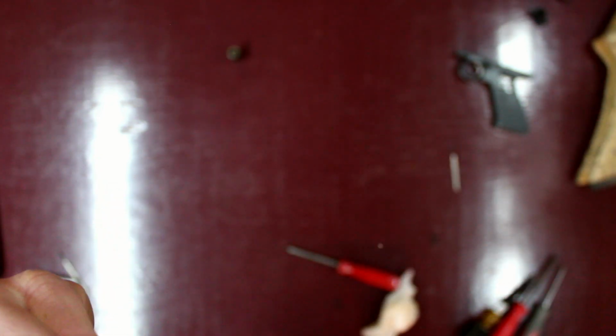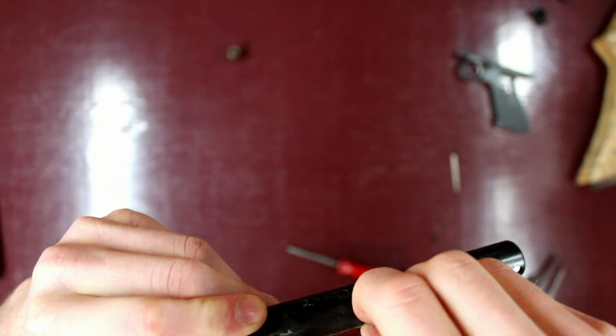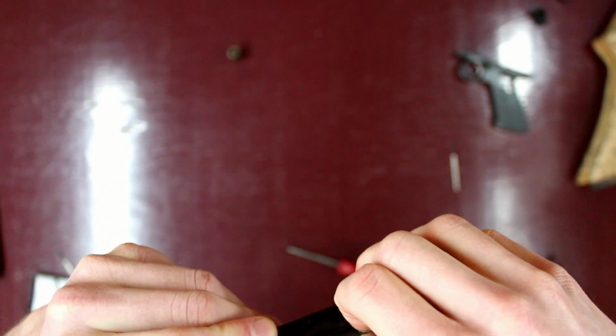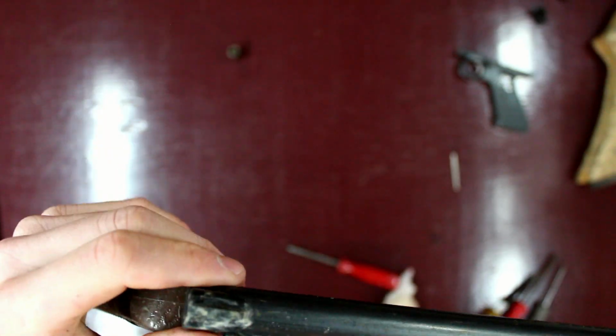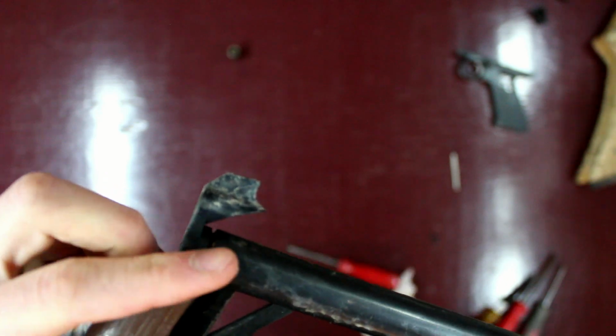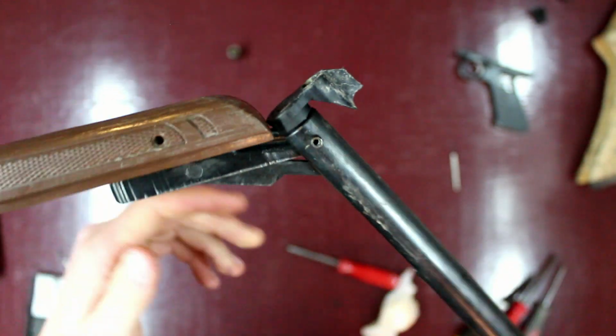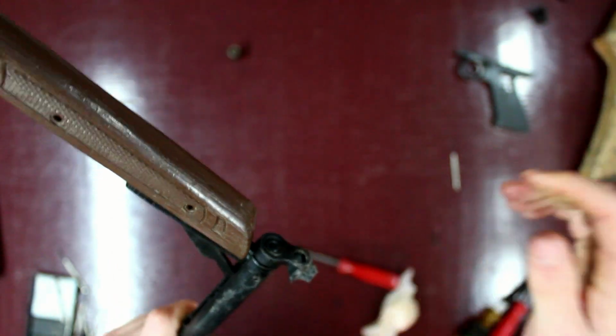And then right here, guys, if I look, yeah, there is the air exchange valve. You can take that out, but it's really a pain in the butt to put back in, so I think I'll just keep that in for now if I can. But I probably have to remove it later. So for the piston arm, guys, you're going to want to take this pin out and replace it with a screw because it's a real pain in the butt to take it apart again. So yeah, let's just take that out with a hammer.